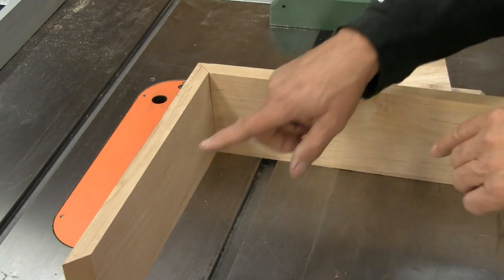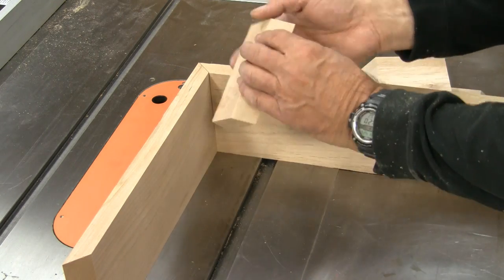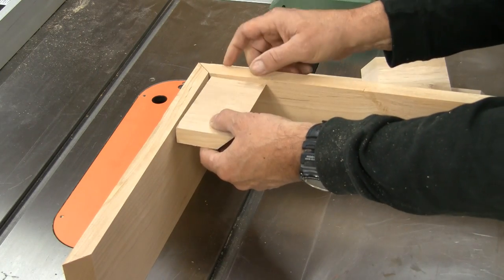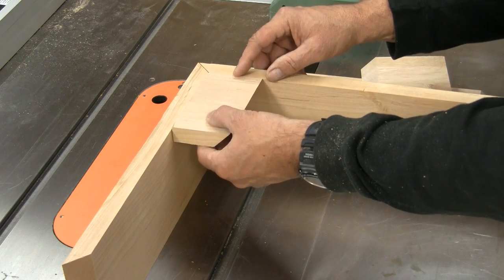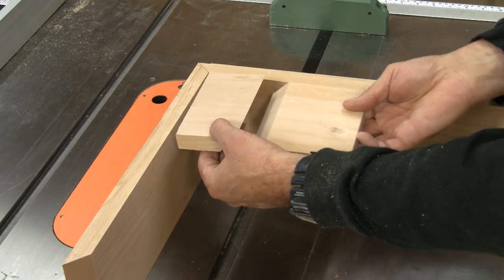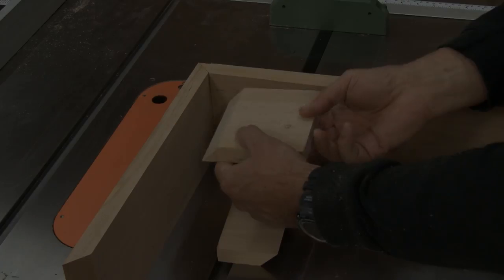And they look good. On our cabinet, we're going to use something called a cleat system. Some people call it a French cleat. And basically, it's a piece of wood like this with a 45 degree angle on it. And of course, it'll go all the way across the top and just down a couple inches or so on the side. And it will pair up to another 45 degree angle like that. And that will be this part here, of course, will be mounted on the wall. You will drill nails through from the underside here.